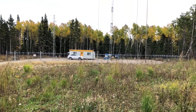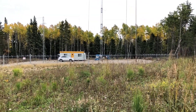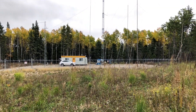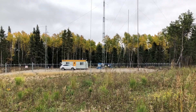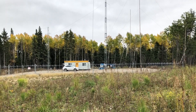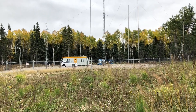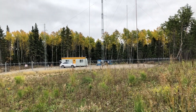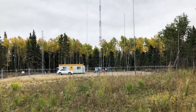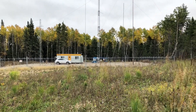These short, vertical, high-impedance antennas are what I'd like to call a more civilized antenna than beverages. Beverages are easy to build in the sense that they usually want to perform and will perform, but they're a lot of work, a lot of maintenance, and they're not pretty. Whereas a short, high-impedance vertical array like this — and there are different types — it's a lot easier to work on. I consider it a more civilized receive antenna. 73, that's Steve, V6WZ.